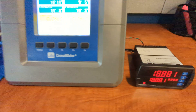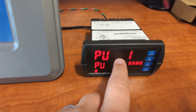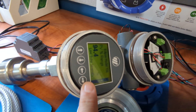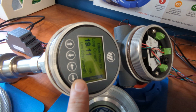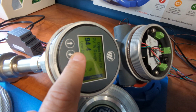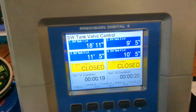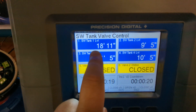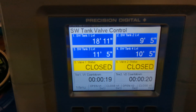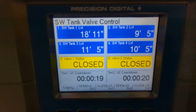And that's exactly what's happening here. As I pull out PV1, which is telling me that there's 18.9 feet of level in that tank, it's getting that information from the Modbus transmitter, seeing that there's 18.9 feet in that tank. And every time that Magnetrol transmitter responds, the Consolidator Plus is capturing that value and using it as an input that we're then controlling alarms and other display information off of.